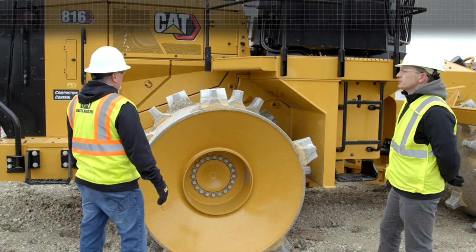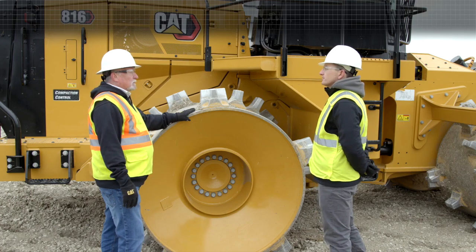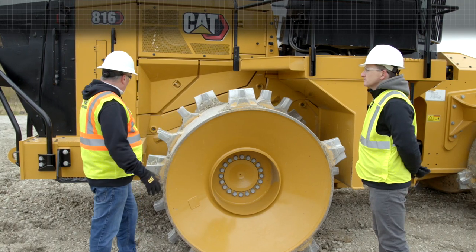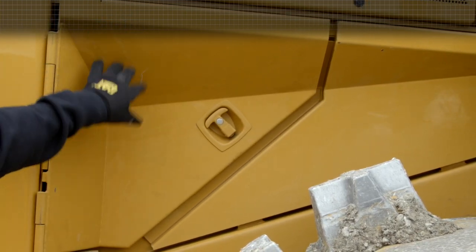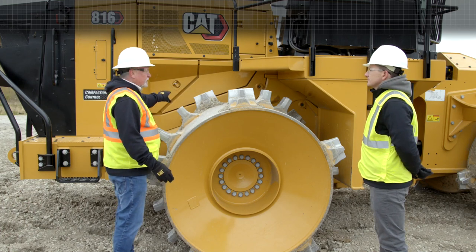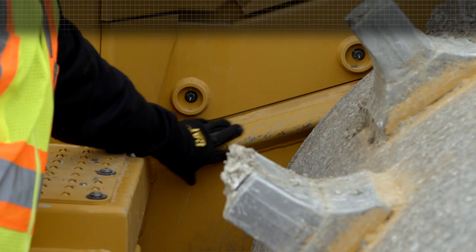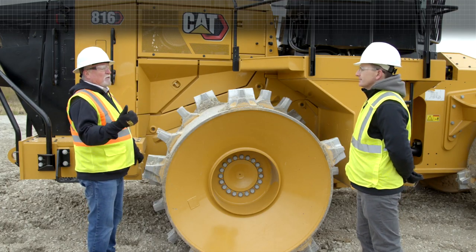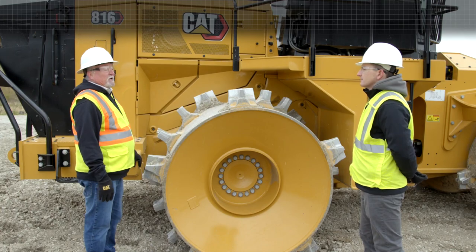That sounds like a great quality improvement. Let's talk a little bit more about the improvements we made on the hood enclosure doors and what we did to thicken those up. These doors — every now and then, if the striker bar misses something climbing up, it was hitting these service doors and knocking them off. So we went through and beefed it up. We got more robust framing around it, and then this hockey stick frame on the bottom we really strengthened. We put deflectors in — we're about deflecting the energy that's climbing up on these machines and pushing it away without absorbing it into our structures, which keeps it more productive and longer lasting.